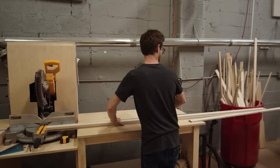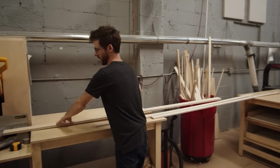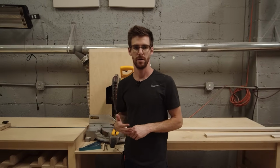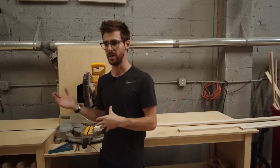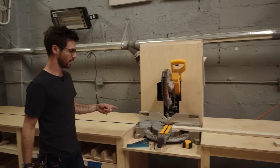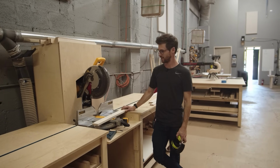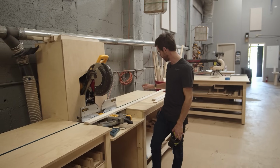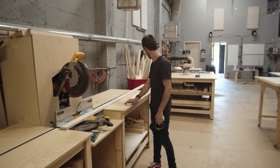All of our frames are pretty standard sizes. If we have a 4-foot by 2-foot panel, the outside dimensions of that panel are 4 feet by 2 feet. So the insulation on the inside is going to be a little bit smaller to accommodate the offset of the wood frame. We're going to have 2 pieces that are 23 7/8 inches, 2 pieces that are 46 1/2 inches, and then from our 1/2-inch board, we're going to have 1 piece that is 22 1/2 inches.